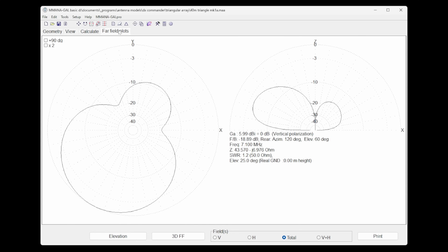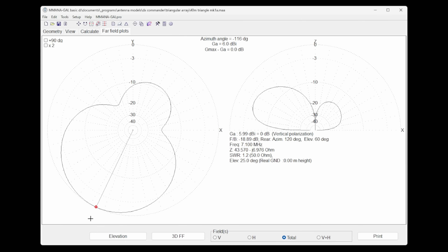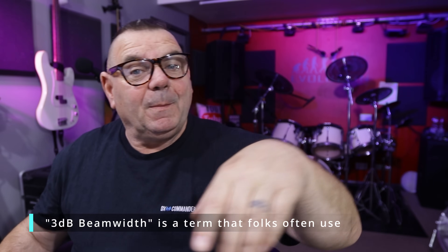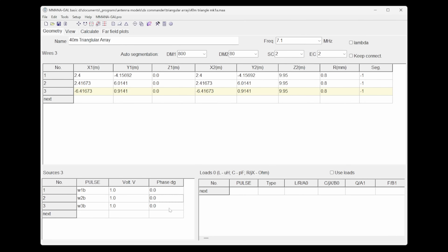With a relay box you can steer roughly 120 degrees. So you could have it pointing over here, or we can change it by putting the phase line somewhere else — we were pointing right, now we're pointing south-southwest. The 3 dB beam width: the best gain is around zero dB here, and coming around to minus 3 dB on each side, that's about one, two, three, four, five, six — so roughly 120 degrees of 3 dB beamwidth.